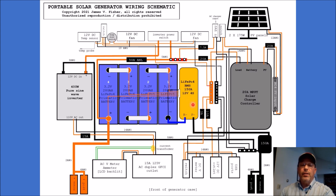There's a battery negative connection that attaches to the most negative terminal on the battery. This configuration isn't identical to the way my BMS is set up, but you can see these balancing leads — it's very important to pay close attention to those to make sure that they are connected to the correct cell. They are cell specific. There are four red leads positive going to the positive leads of cell number one, two, three, and four, and your negative lead from the BMS balancing lead connection goes to the most negative battery terminal.